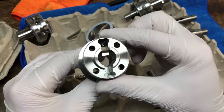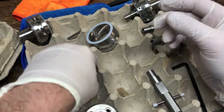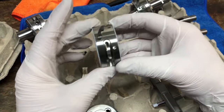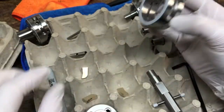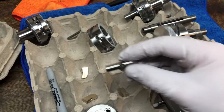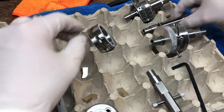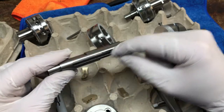There is the main body that houses all the bits. There are two bronze catches that are the lockouts for the shaft. There's a cam ring that drives both the load pin and the lifters that undo the catch. There's a spring carrier — this goes inside of the shaft and holds two springs. And then there's the main shaft part that has the ridges for the catches and the guide slots.